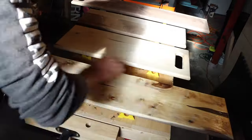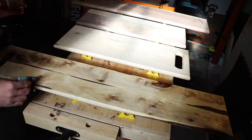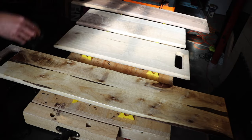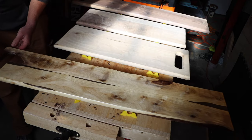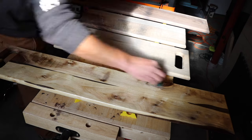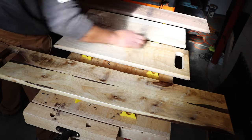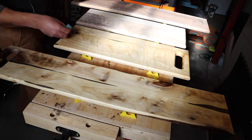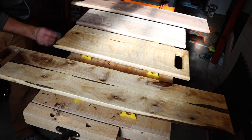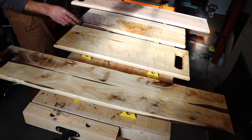Now I am just doing a coat of tung oil here. I've cut it with a citrus solvent, and I'll put some links in the description for the products that I use. I'm going to give another shout out to the Wood Whisperer, Marc Spagnolo, for the tip on the tung oil. I think he actually got the mixture — the tung oil and the citrus oil — from a suggestion from somebody else. It went on really well. It's a little bit thinner so it doesn't glob up as quickly when you're using that solvent.